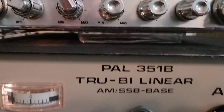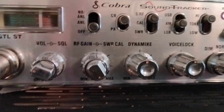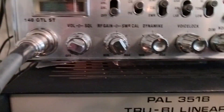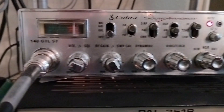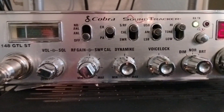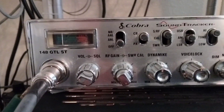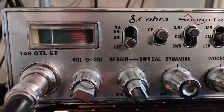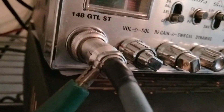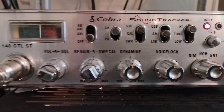I'm trying to get rid of the squeal. I've got a radio laying on top of an old tube amplifier, nothing's grounded, coax is too long, power wires six feet long dangling in the air — so it's hard telling where that RF is getting back in. I took an alligator clip and put it on my microphone connection and grounded it. Did that get rid of the squeal?